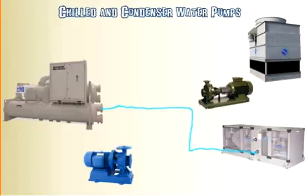Alright, so we've got the chilled water coming at the bottom of the coil. Now we want to draw the water coming back out of the coil that's ready to go back to the central plant and get cooled down again. So that'll be this darker color here. And we'll send it this direction. And I'm sorry, pipes don't normally go on a diagonal slant like that, I promise.